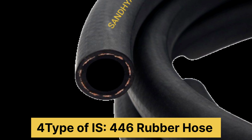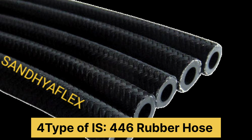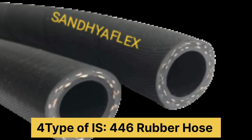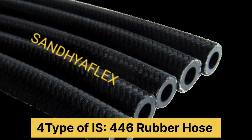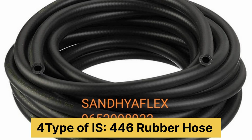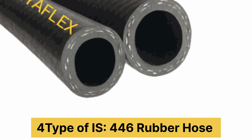Type 1 is for working pressure 0.6 megapascal. Type 2 is for working pressure 1 megapascal. Type 3A is for working pressure 2.5 megapascal. And type 3B is for working pressure 2.5 megapascal with oil resistance cover for washing and similar purposes.